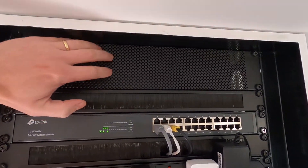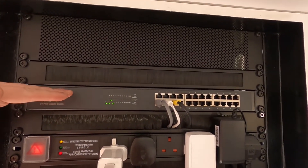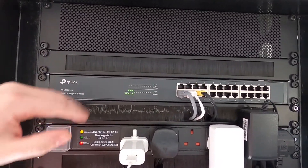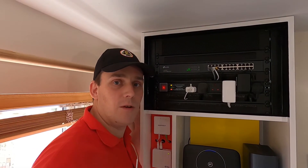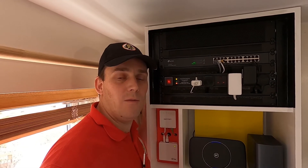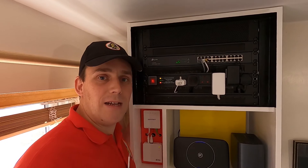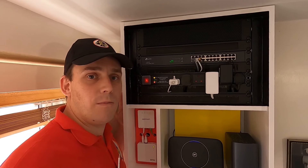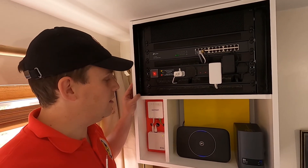At the top we've got a 2U passive vent — no active cooling, it just cools itself through heat dispersion. Works brilliantly; I'm absolutely delighted with it. Next video will be the installation of the 20-plus network points around the house, all feeding back into this unit. Overall I'm delighted — it saved me about 85 and a half quid over the cost of buying a full-size pre-built cabinet. I think it looks absolutely brilliant, and it gives me the capacity to expand and alter it in the future. Thoroughly good job.